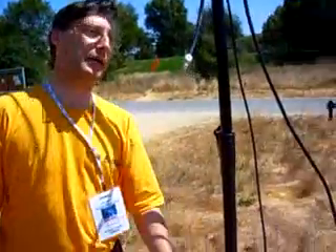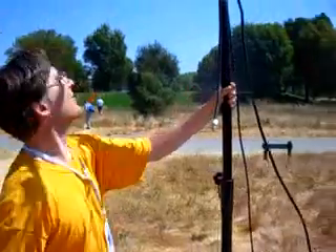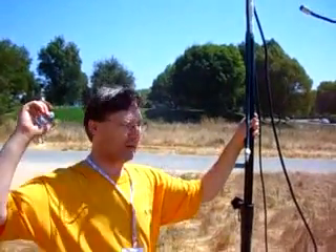The range for broadcasting would be about how far? This is basically the South Bay area. It could probably be up to 20 miles if you have a good line of sight — a fairly flat area. It's line of sight you need if there are no obstacles. Obviously in a forest or in cities with trees and buildings it's different. Yes, that's a directional antenna — a Yagi — aimed towards the east foothills.